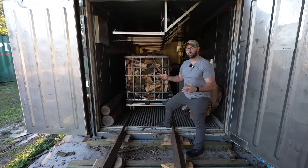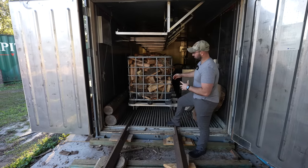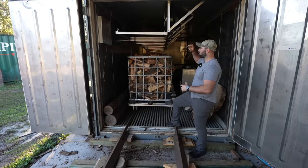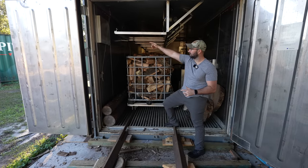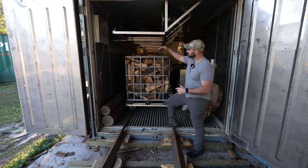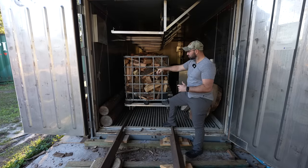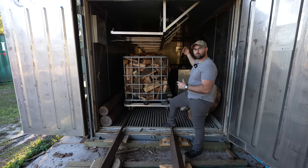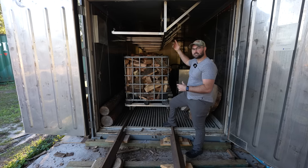For those of you wondering how the kiln dries the firewood — typically with this dehumidification kiln, you've got the compressor unit over here, it creates the heat, pushes the heat up, this whole row of fans takes that heat and air and pushes it that way, it hits the wall, goes down the baffle system, hits the wall again, and then comes through the wood. When it comes through the wood, the compressor sucks all the moisture out through the wood, compresses the water, pumps it outside the kiln, and just continues that cycle over and over.